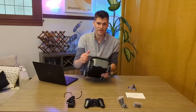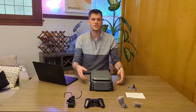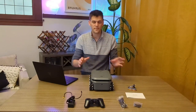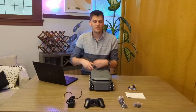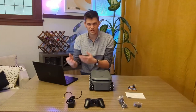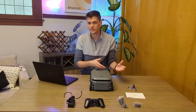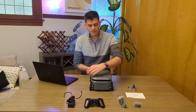On top of the SLAM sensor, it also has a 5-megapixel camera, which is super helpful if you're looking to do some kind of machine learning project — detect certain objects in the room, use the LiDAR for localization and mapping, and the camera for extra navigation, landmarks, or detecting AprilTags or ArUco tags.